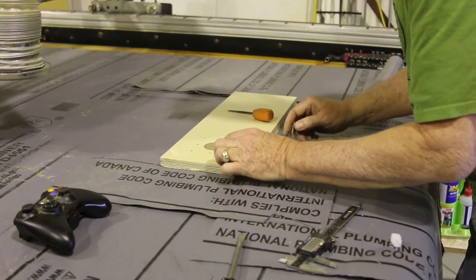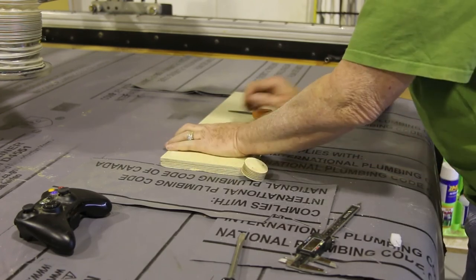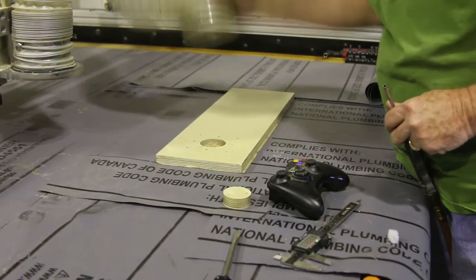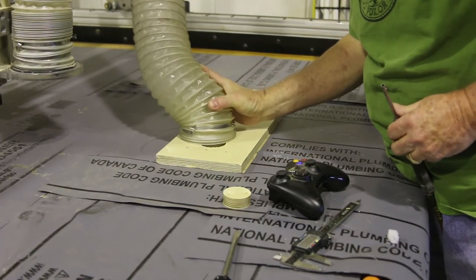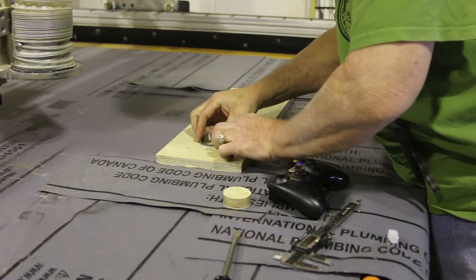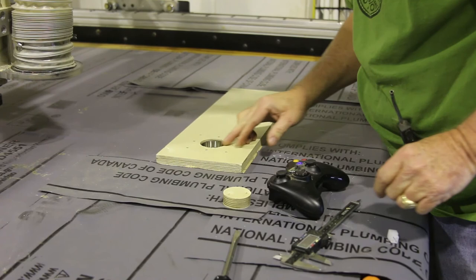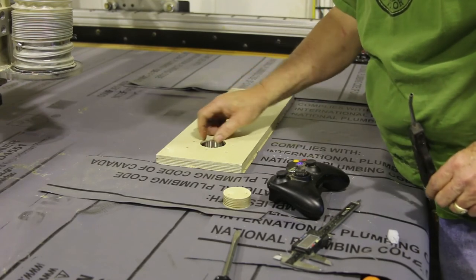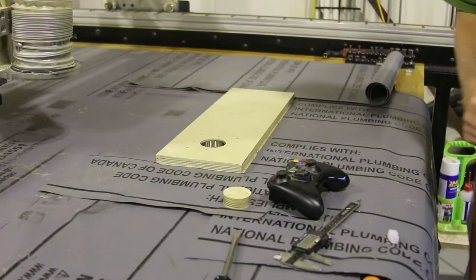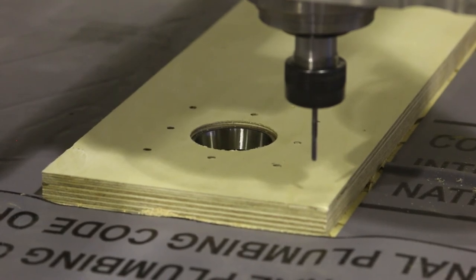To the side and went back to the CNC, and I just instructed the CNC to cut the hole like 100 thousandths more than it was, just to try to inch up on getting the right size. And that's all it took, was about 100 thousandths more, and it went right into place and cleaned up really quite nicely. It was then time to cut the outside portion of the bearing block.